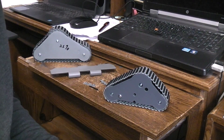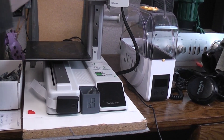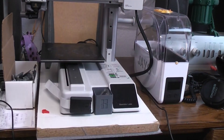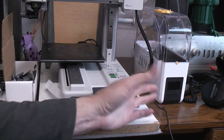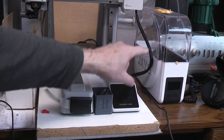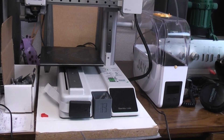For those interested in the printing setup: here's the A1 Mini, and over here is my heated dry box I used to use with the Prusa. I connected it up to the A1 Mini — just a tube — and stick the filament and TPU in there to pre-dry it and feed from there rather than the back spool holder. It works great even without turning the heat on. I did some videos on how I modified that old dry box, adding a top vent and a bottom vent to allow airflow to remove moisture from the filament. But back to the project.